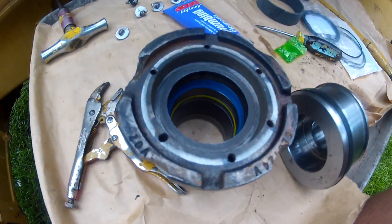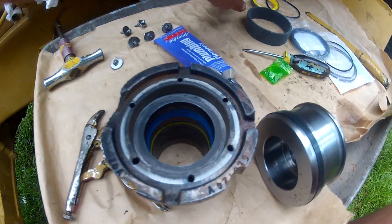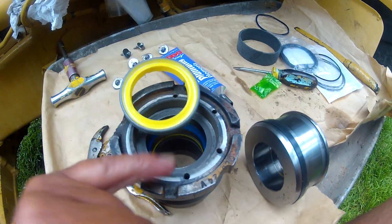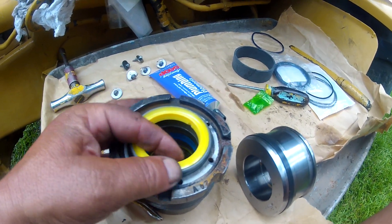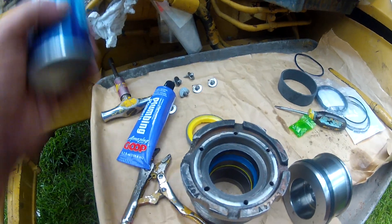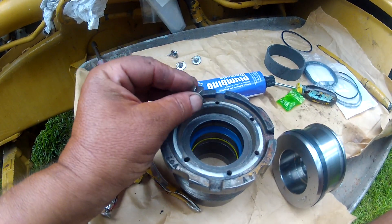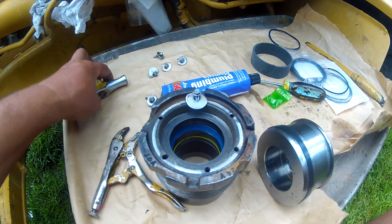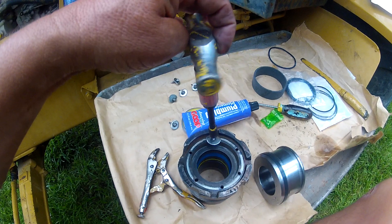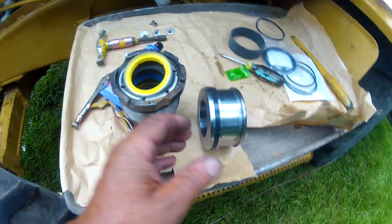Notice there are holes drilled about every inch and a half around the perimeter. Those holes are to hold the wiper seal in place, because originally they use a special glue, but after 17 years you lose a few thousandths of metal and sometimes the glue pops off. So you sand the surface down, clean it with acetone or starting fluid, place the seal in there with the goop, and then take one of these self-tapping screws — I made special washers out of stainless steel — and put them into those holes to hold down that wiper seal.